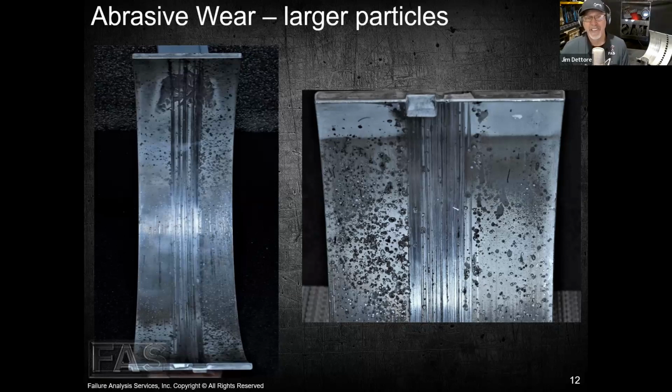One of them that we talk about in our classes is a dead blow hammer, the leaking dead blow hammer. Are you familiar with what a dead blow hammer is? Oh yeah, we call them chop hammers, but yeah, dead blow hammer. So you see the one where the face on it's kind of flapping, right? And the canister inside's all dinged and dented up, and it's been leaking little BBs into the component every time you use it. I was doing some QC on an engine overhaul a few years back, and I walked in, I saw a hammer just like that, and guys were doing their toolbox meeting, and the guy looks over at me, he's like, I was gonna replace that. Probably after the overhaul, right? But that's another place we see just crazy stuff.